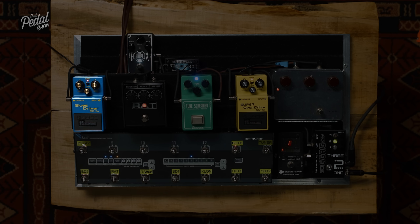So the different colored LEDs have different forward voltages. For example, I think the red LED is 1.6 or 1.7 volts, and as we go up through different colors, we have different ranges of forward voltages. That means if you're using LEDs as the clipping stage in your pedal, you can have different sounds by having different colored LEDs in there. It's awesome. So what the Aegis does is give us the option to throw in some of those LEDs as part of the gain clipping circuit.